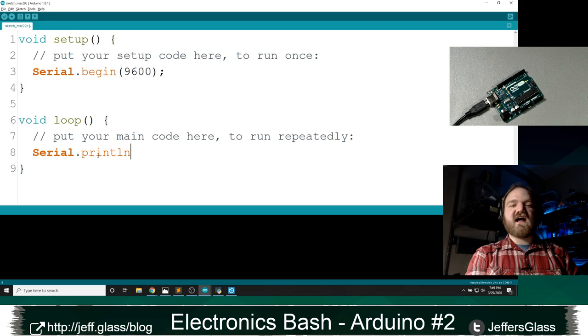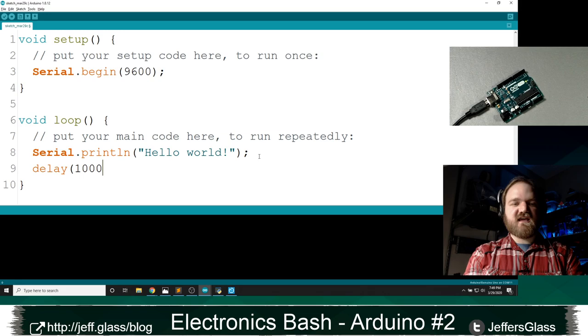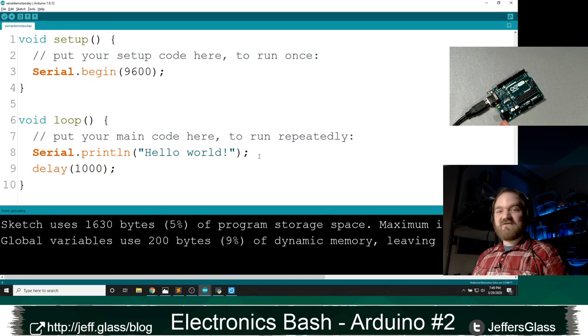"Hello world." Hello world is in quotes, right? Which we'll see why in a second too. And I'm going to delay 1000 and we'll upload. Let me save. I'm going to call this serial demo and upload. We don't really need to come back over here.